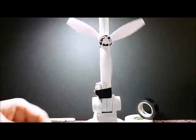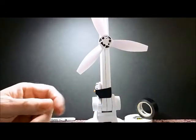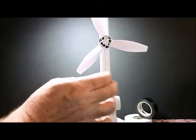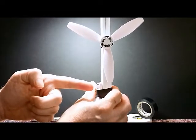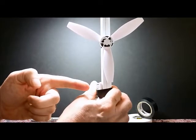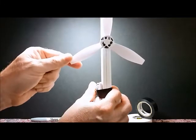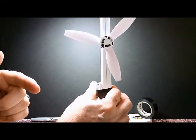Now when this settles out, it should have the heaviest part of this assembly facing down. Sometimes it doesn't really stop — as you can tell it binded. You can vibrate it with your fingers, or you can use a vibrating motor that I've attached to the structure here to allow it to settle out a little bit easier and more precisely.